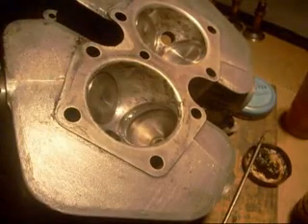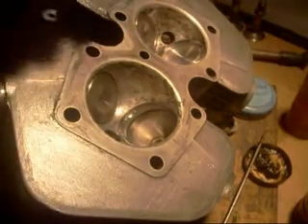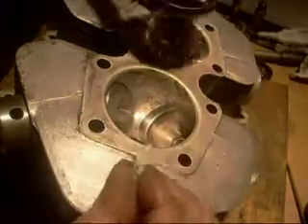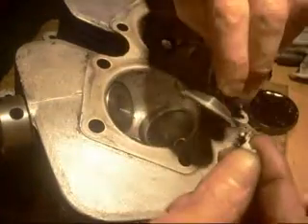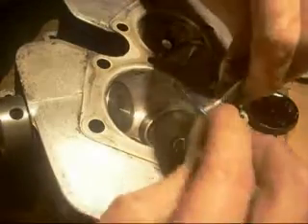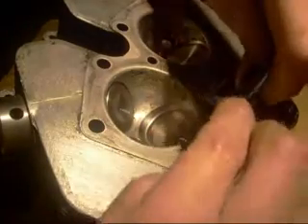Clean all the crap off and we'll check it with a blow. All that's nice and clean. Now, the engineer's blue — I'm going to use a little piece of tissue. It's like thick ink, this stuff. Just wipe it round the edge. You don't want a build-up of it, you just want it marking. Because you don't want it to take up any space.